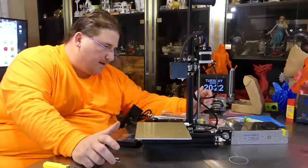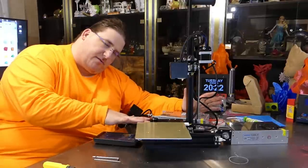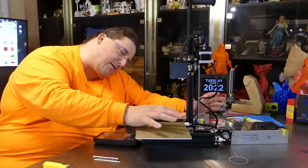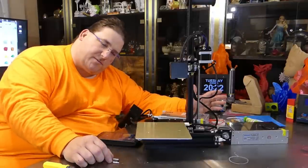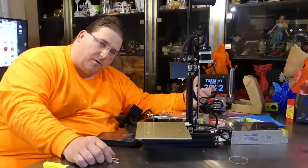That is a dead printer. I plugged it in, the printer is off, and yet the bed and nozzle started heating up — I only noticed when I put my hand near it and felt the warmth. I swapped power supplies and it made no difference.